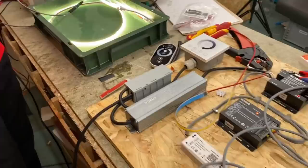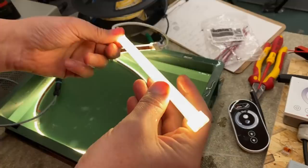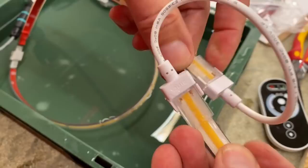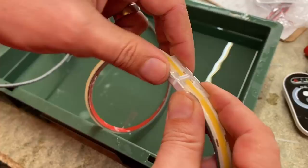We did that footage last week and it's been in a tank of water since — just to check that our work makes the grade. No dotting at all. That is the advantage of chip-on-board LED strip. If you switch it off you can see the end cap, move down the strip to the joining piece, and see where those connectors have pushed through the circuit board. On the back are the polarity markings, and then there's our inline connector. The chips are so close together on chip-on-board that you essentially do not see that join point and lose no light.